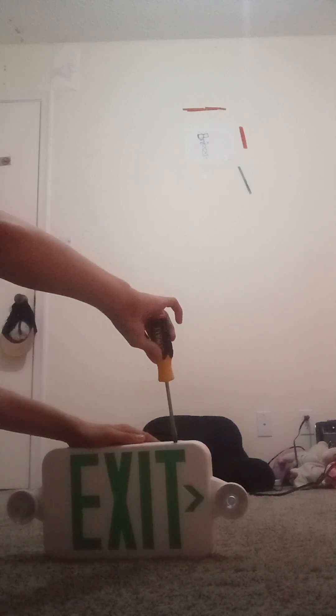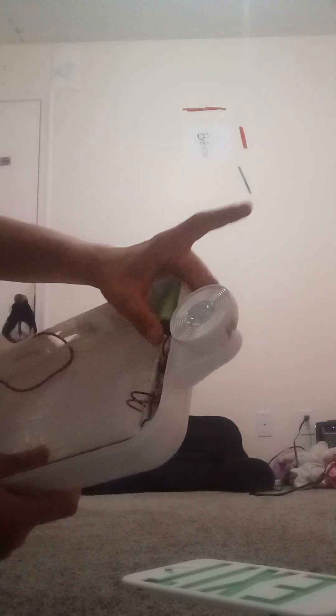This unit is for indoors, not outdoors. To install onto the wall, if you have a junction box that can fit, you simply open the unit with your screwdriver, get your two screws, turn it to the back, put the back box — the junction box — in it, and make a big circle opening so the hole can fit with your wires through it. Also, there's a yellow and blue wire here — the yellow and blue wire is for the transformer and the lights.